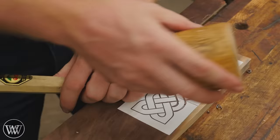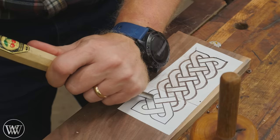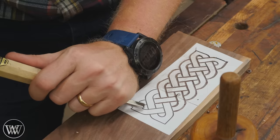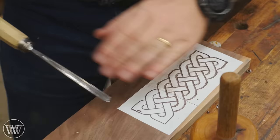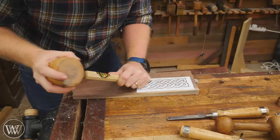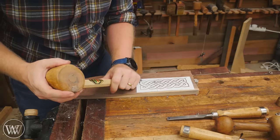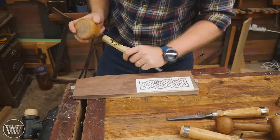What I generally do is grab a small mallet. I can start it in here with very light taps. This gives you a lot more control and ends up being a little bit faster. Put it in at an angle, lift up the chisel so you're diving in, go down into your depth, and then bring it into the cutting angle so you're riding that bevel — so the bottom edge of the bevel is parallel to the surface of the wood, making the same depth cut all the way across. Then just run around chasing these lines. I'm not putting much force on it; the mallet is just lightly tapping. This gives you far more control than doing it by hand, because each tap only moves the chisel a little bit forward and you can control that amount of movement very easily.